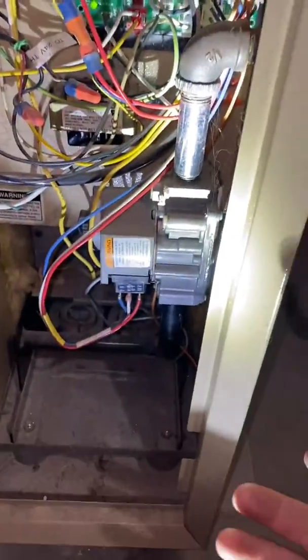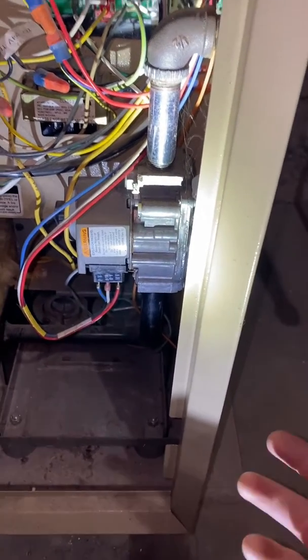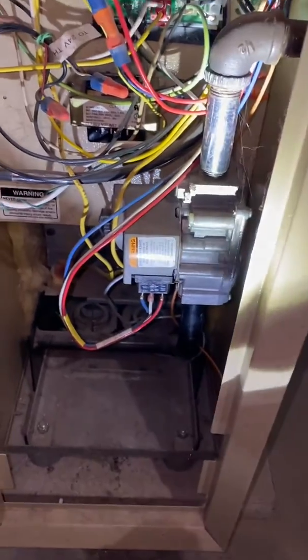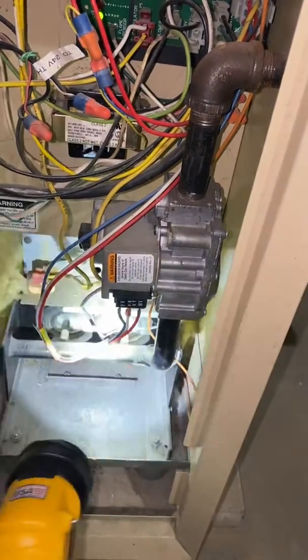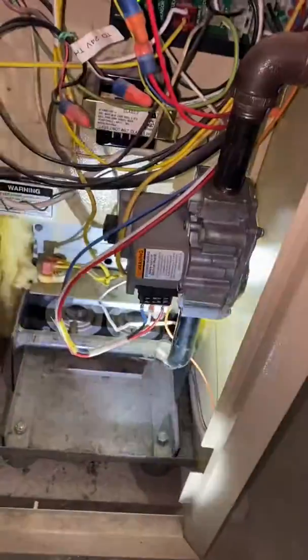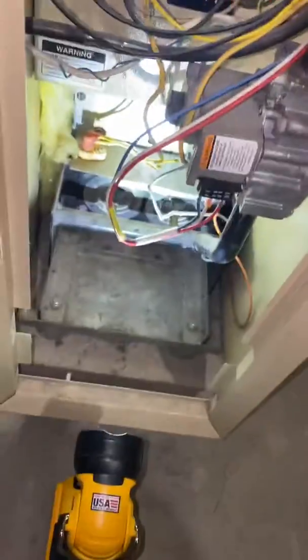Not touching every little detail you're supposed to do when you do maintenance on these boilers, but obviously, what I usually do — I always clean those orifices. I poke them, because sometimes they get clogged. There's a little pinhole right here, and therefore you can have issues.